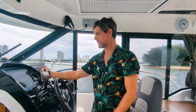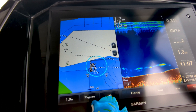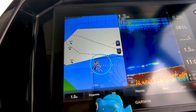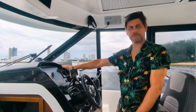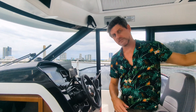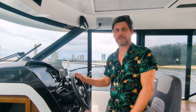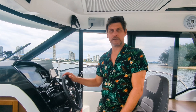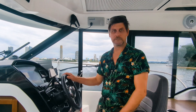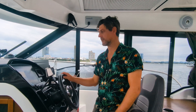Probably the most useful thing with this device is the combos, which I use all the time — mostly the one which gives you your chartplotter and depth finder all in one. Something to note about the depth finder: it doesn't really work when you're going fast. The transducer is on the stern of the boat, so if you're hurtling along at 20 or 30 knots you really can't depend on the depth finder. By the time it tells you how deep you are your propellers will have already hit. It's good for manoeuvring around marinas or if you've got to go through some sandbars — take it off the plane, go through at 6 to 10 knots and the depth finder will certainly work for you.